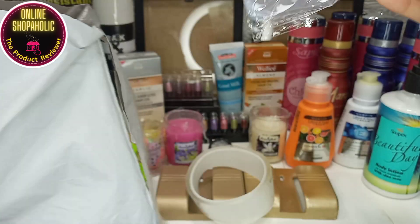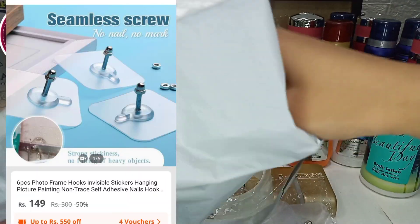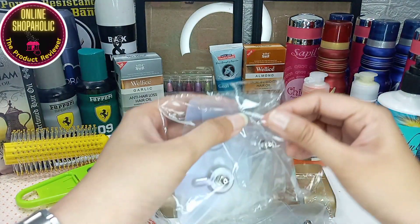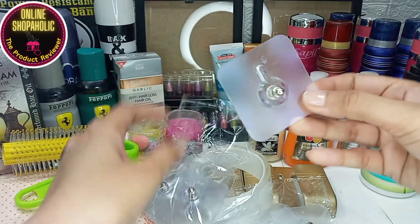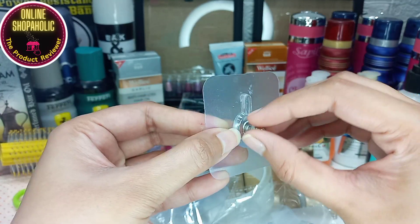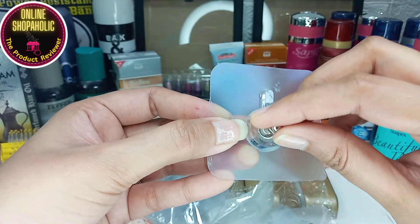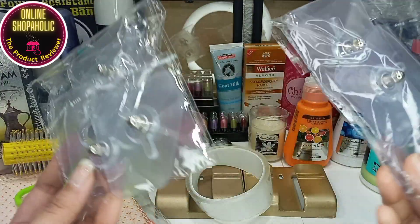This is also from the same family — self-adhesive nails. For people who don't like to drill on walls, I recommend these. They are self-adhesive nails, very safe, and carry good heavy weights. The secret is that you have 24 hours after pasting them on the wall before hanging anything. If your walls are dusty, clean them first, and then after 24 hours it can easily carry heavy weights.